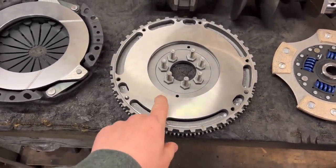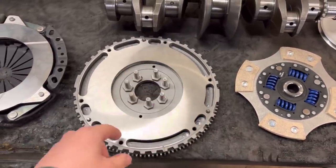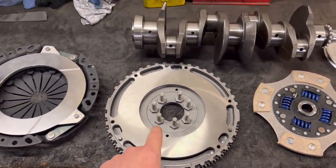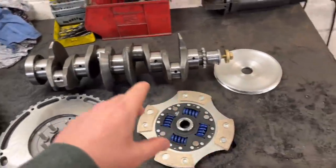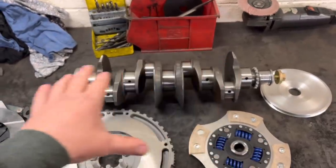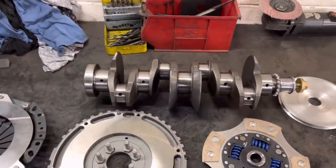As you can see here we've got the flywheel which has been lightened on the back face and slotted on the outside to remove quite a lot of weight — this flywheel is now down to about three and a half kilos as opposed to eight and a half. This is all laid out ready to balance. In one of the next videos this week we'll get Carlos to show you how we balance this and see how far the flywheel and crankshaft are out now we've removed that weight. Thanks ever so much for watching — please smash that subscribe button, comment down below, and we'll see you in another video tomorrow. Take care guys.